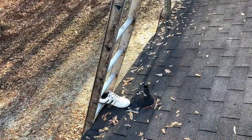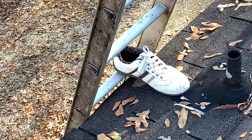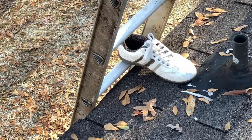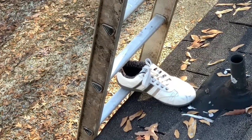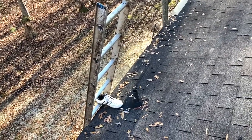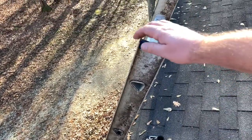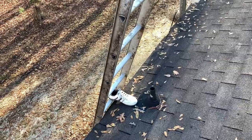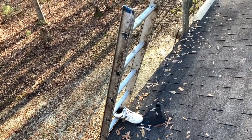I want to give you some safety advice about getting up and down a ladder, especially from the roof going down. I've got the ladder positioned so that a rung meets up with the roof point — that way, when I step my foot there, I have my foot on a rung and on the flat of the roof, which keeps the ladder from wanting to move out from under me. I also keep the ladder raised up about four feet above the roof line so I can put my hand there as I step around and get my feet safely positioned on the roof. And again, I'm no expert — this works for me.